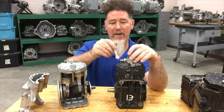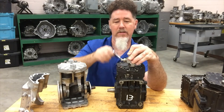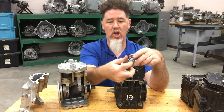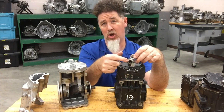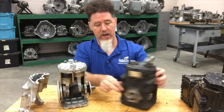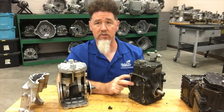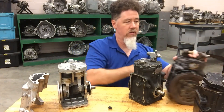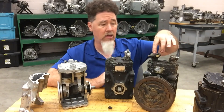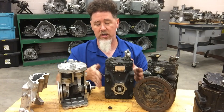If you want to check your oil, the problem is you need to go all the way to the fully front seated position. This is the front over here, and now the valve is all the way pushed in — it's actually closing off this port right here, so refrigerant cannot get in or out. You want it in the front seat position. Now when I open my bolt to check my oil, only the refrigerant inside this compressor is going to leak out. You're going to want to do that on both cylinders — one will be the suction hose side and the other the discharge hose side.